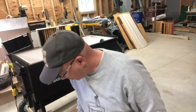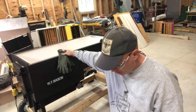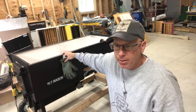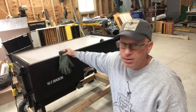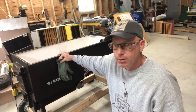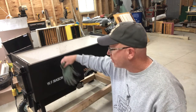Hey everybody, you can see behind me I've got the arch insulating paper installed. Now we have to put some fire brick in there. The fire brick will sit on top of the white paper and extend the life of the stove, focus the heat up toward the pan — hopefully all that in an effort to get syrup to boil faster.